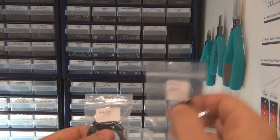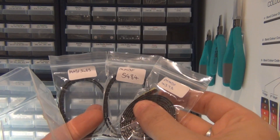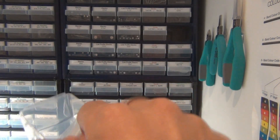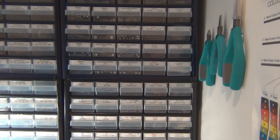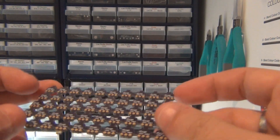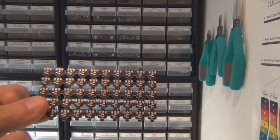The J201s you use a lot. The 5457s you use a bit too. The other three in the range I don't think you use very often, so I wouldn't bother stocking up on those. But the J201 and 5457 - I'd definitely buy a few of those. Get some adapter boards with them so that you can solder the SMD JFET onto the adapter board. That way you'll have all your FETs ready and you know they're not fake or out of spec and are going to work properly.